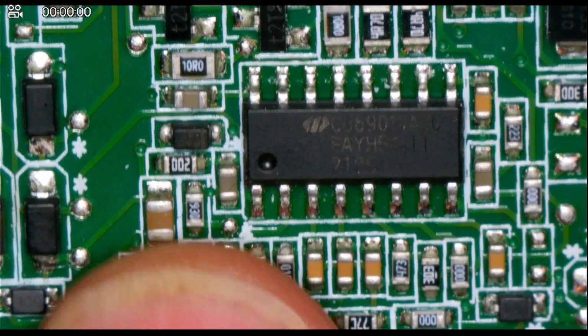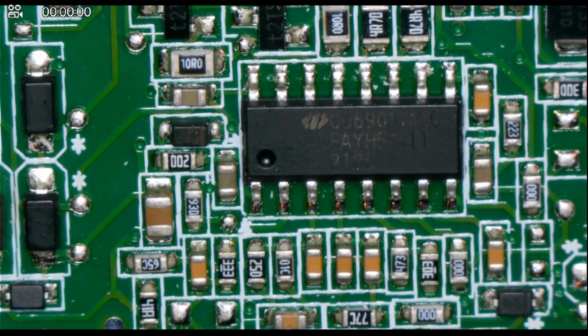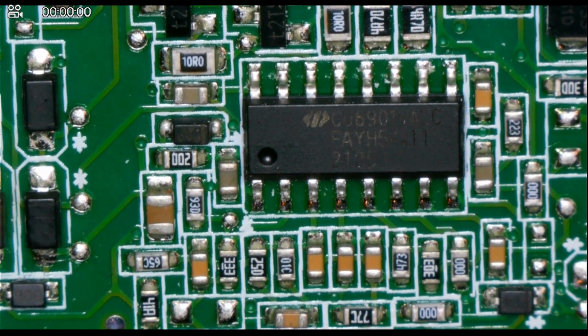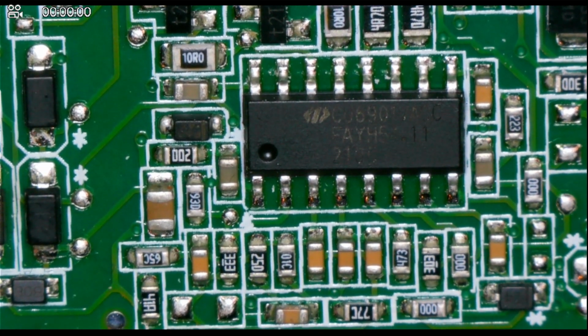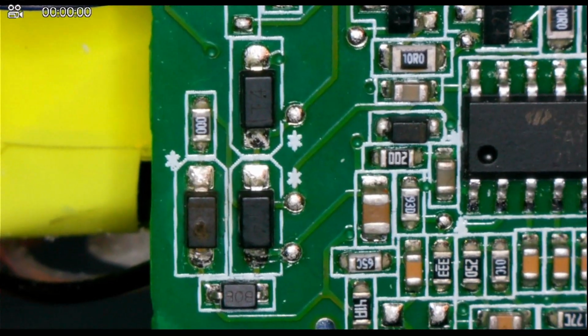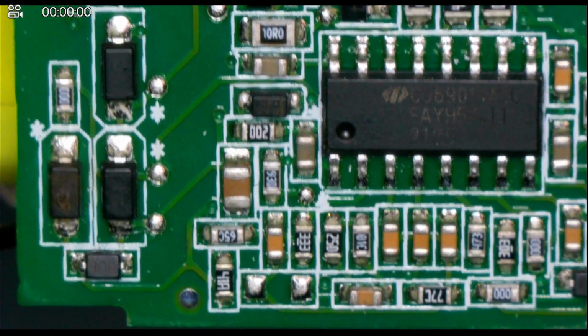I mean, I have gone round and checked resistances and such on the resistors round the board. I've checked, like I said, all the capacitors. There's no shorts to ground, so everything else does seem fine, and that's the only area where there's any visible damage. Right, so we shall be back.